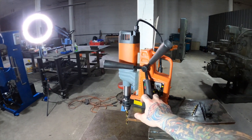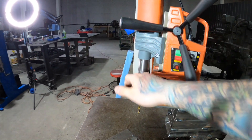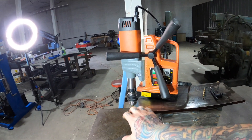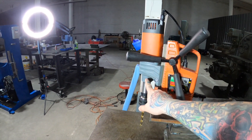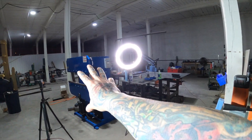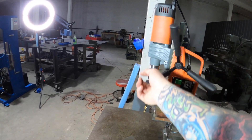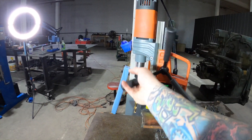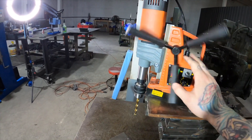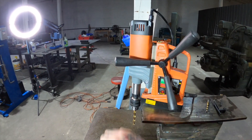But if you want to magnetize this to the side of something and use this chuck that takes drill bits, it's worthless. Annular cutters will go in there, and as long as they're not over two inches, they'll work magnetized to something like that. So that's one of the negatives of the drill. You don't have to use this chuck if you don't want, but it costs more money to have it.